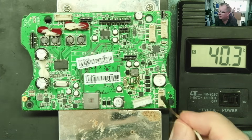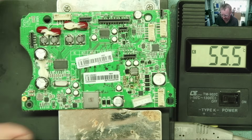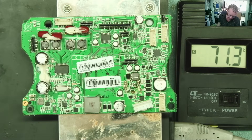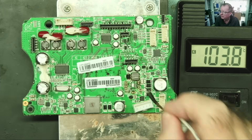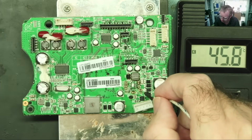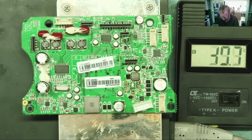It'll take a little while because of the thermal mass of the actual PCB. I don't think I'll actually get this board hot enough to actually melt the solder using just the preheater. It's getting warm. The trick with this is not to try to heat it up too quickly — just have a bit of patience. Flux will start to smoke in a moment. So I'll turn it up more towards full now, and let's put the chip on the PCB.